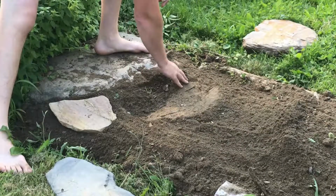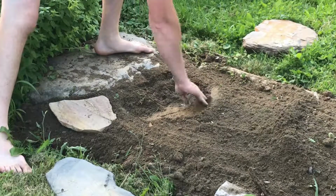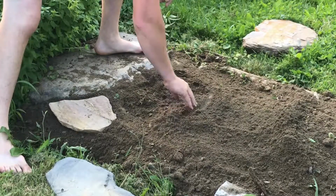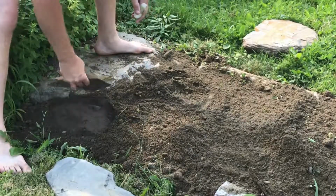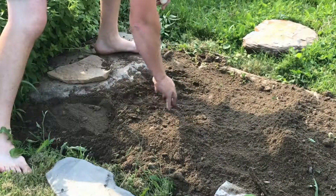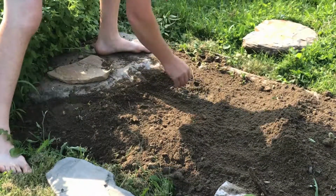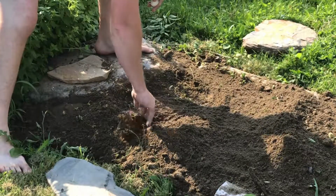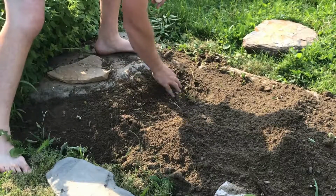For this half, I'm going to leave the fieldstone a little proud of the logs, and also try to put a crown in the walkway to help it shed water toward the edges instead of relying solely on the drainage gravel I put down as a base. My ultimate goals are for the walkway to look nice, withstand foot traffic, and for the lawnmower to pass over the edging easily to make for less work in maintaining the edge of the lawn.